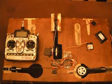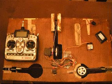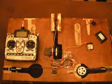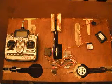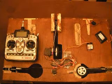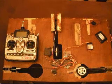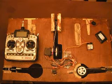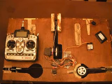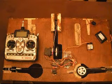This is the test bed used to test the functionality of the gear system mixer. As you can see, it's a very crude affair, but that actually goes some way to prove the point of the mixer. The mixer is designed to ease installation for complex gear systems where perhaps different servos need to be used, or they're in awkward-to-reach positions within the aircraft, making it extremely difficult to have symmetrical linkages as would be required without the mixer.